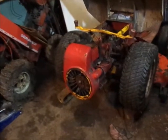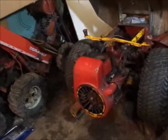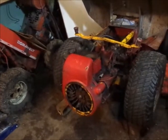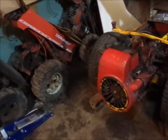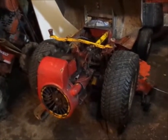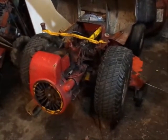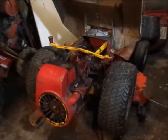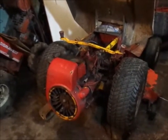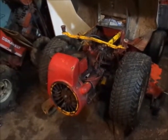I have a '71 430 Onan NB. I have a '71 450. And I have the, it's either '70 or '71 432, but I'm pretty sure that was originally a 424 frame and transmission anyhow, because only 424s were orange. I bet you a lot of you guys didn't know that. 424s were actually orange their whole life. And if you see a red 430, they were repainted by somebody.